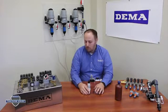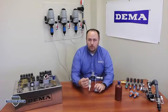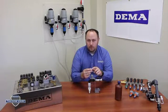If you're using either one of those, I would suggest every 3 to 6 months replacing the metering tip that's inside. One last thing I wanted to talk about was the dual bar that you can actually put into the unit here, so you can inject 2 chemicals at once and independently control the dilution of those 2 chemicals by using metering tips for each side.